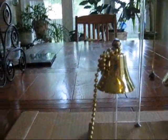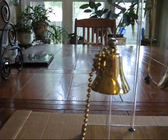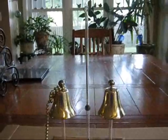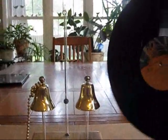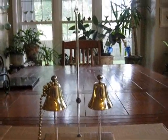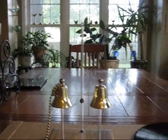One of these bells has to be charged and one of them has to be grounded. This one is grounded through that ball chain to the table, which is sufficient for what we're doing. To charge it, I'm just going to rub this vinyl disc against my head, which is kind of comical, but it provides the necessary effect to make this device work. It's just a device running off of electrostatic attraction and repulsion.